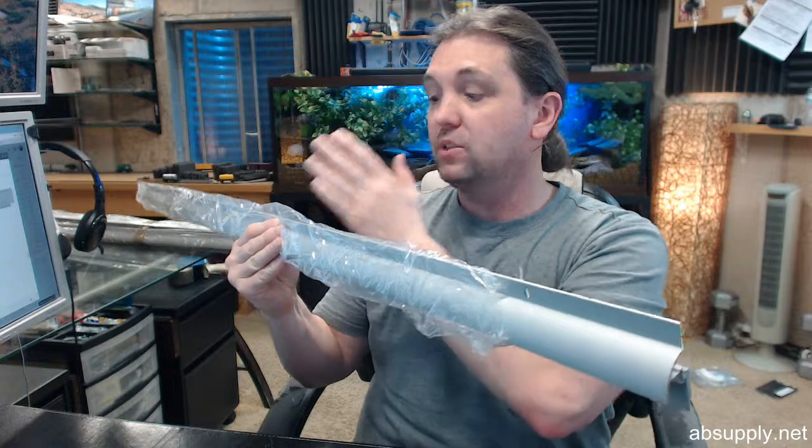A seal that's not proper is akin to having no seal. If you added up 1/8 of an inch by 3 feet, by the time you've got all that square inch, it's equivalent to a hole in the door that you could probably put your fist through. So it's crucial to have a slotted hole to give you that proper sort of seal. So anyway, if you order a custom length, the next longest piece, indicate in the comment field. We'll not only locate that first slotted hole at the proper distance from the edge, but the proper center to center as well.